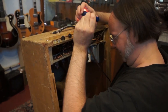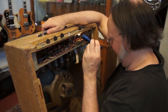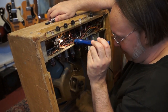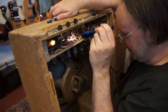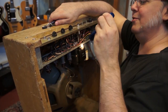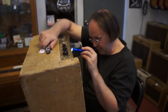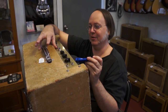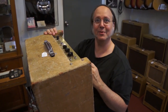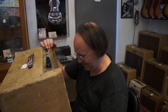The components in this — some of them are the same components everyone used, like Fender used, like all those little resistors. The pots are the same — good quality pots. The switches are similar. This is all stuff you'd buy from an electronic supply house, all generic stuff. The caps are not the kind of caps I'm used to seeing in a Fender. The wiring is fairly high quality — nice old cloth wire, color-coded. The tube sockets look a little cheap to me. This is professional grade electronics, but it's not high quality electronics — a Fender is somewhat better made than this. It's not crap. This amp is midline. It's good without going overboard.